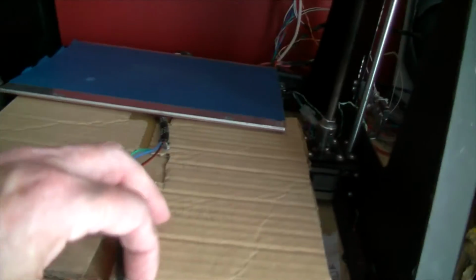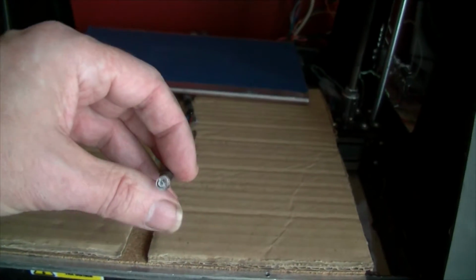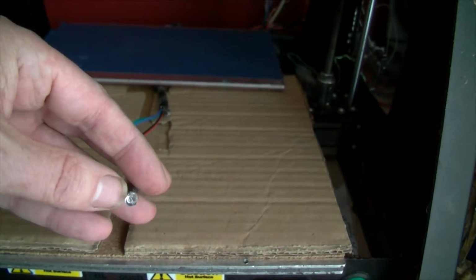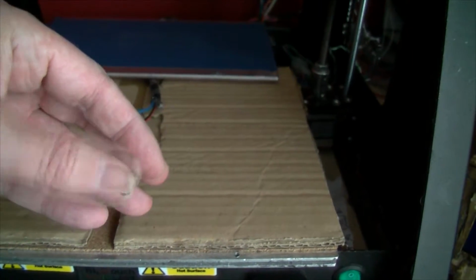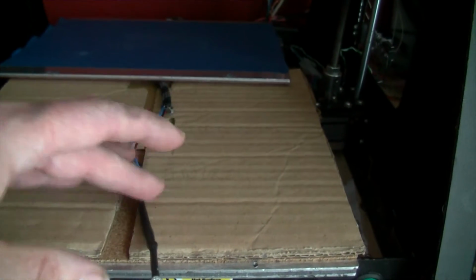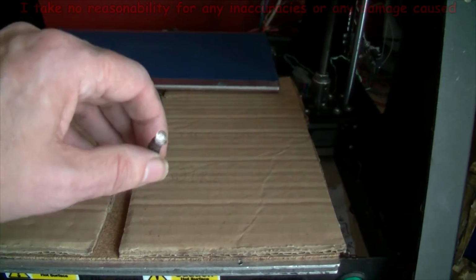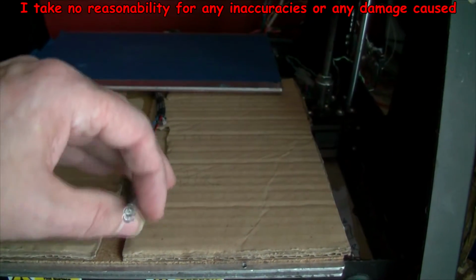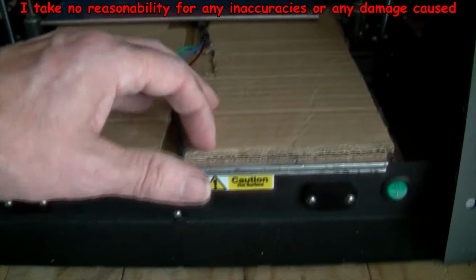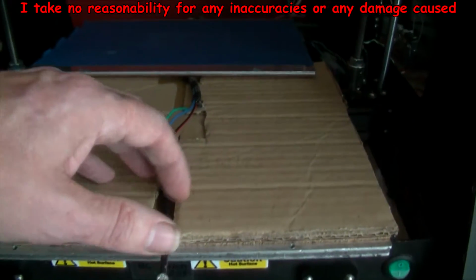Now for yellow, because you can just about achieve yellow with RGB LEDs, you need green and red mixed, but you've got to have a low level of green compared with the red to get anywhere near a yellow. I'll show you this in operation just now.